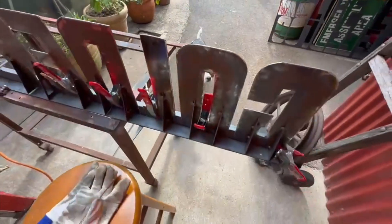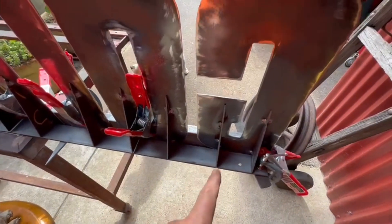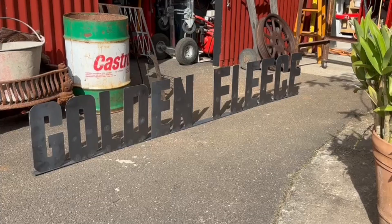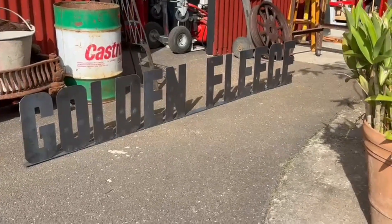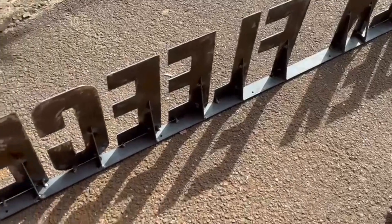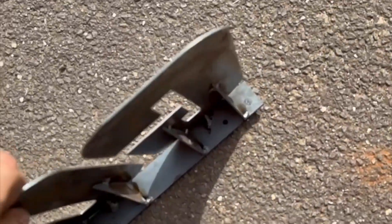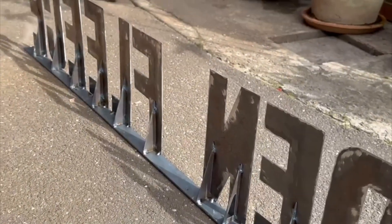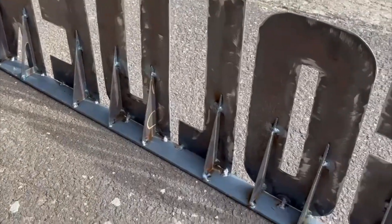We've been working on these letters. We've got little filleted gussets on there — the gussets have been welded to the letters only at this stage. I'm about to weld the letters to the flat steel bar so we can finally put it up on the roof. I've basically welded this together and I'm ready for a little bit of cleanup. I've got to just take away some of the welding marks on the front faces. It's been welded to a flat bit of bar which has got some holes drilled in it so I can screw it to the roof. The gussets do the job of keeping it stiff. Overall I'm pretty happy with it — even though my welds aren't something beautiful, there are at least three points of contact with each letter, so it should hold.